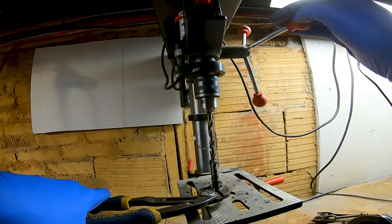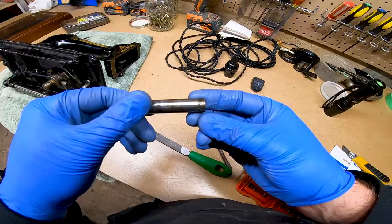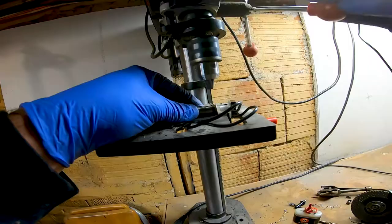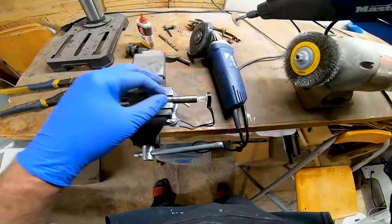Before putting it back in the machine, I bored out a hole in the end of it and then drilled a small hole through and perpendicular to the bored hole. The hole was sized to accept the tip of a rotary switch. Passing the drill bit through the same hole with the switch inside, I was able to pass a finishing nail through the hole to lock the turning part of the switch into position. Placing the shaft back in the hole, the switch is now installed.